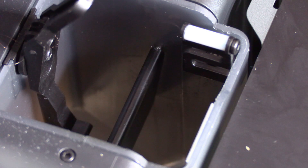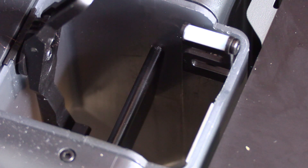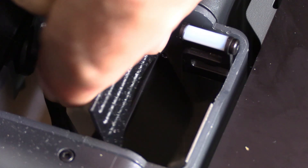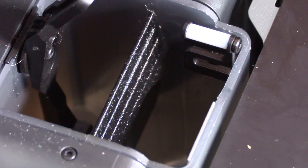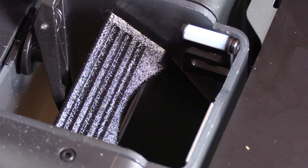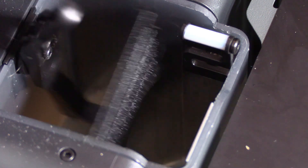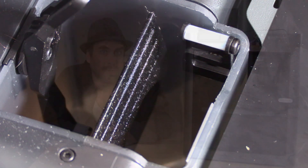Let's go ahead and pop it on. Here you can see the Bambu Lab trap door. This handle pushes that door forward, causing the poop to build up into a ball. When the hot end moves, the door opens and the poop falls — in theory. However, that is not always the case. We will go ahead and snap this little piece right here on top of the trap door. With this installed, while pooping into the chute, the filament won't go over the top of the door because the door is so much higher. Then, when the door is opened, the poop will hopefully fall more properly into the chute and out of the printer. Having completed all this maintenance, our Bambu Lab printers will be pooping a lot more comfortably and no longer dragging filament onto the bed, ruining our multicolored prints.